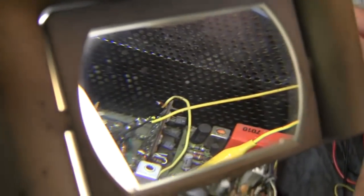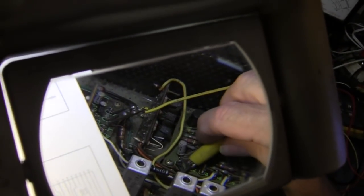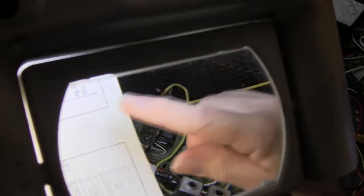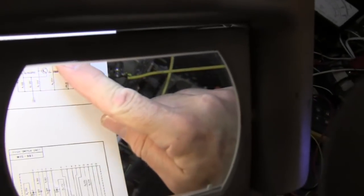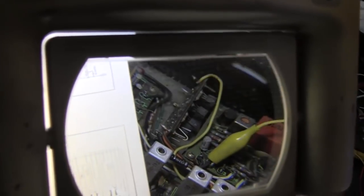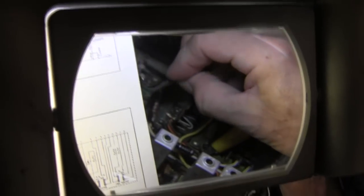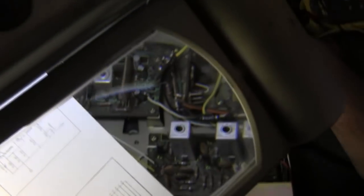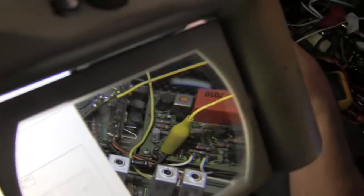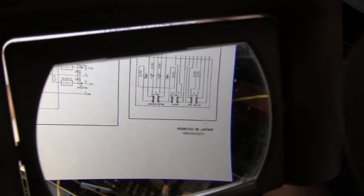There's a coupling cap between the two. Could it be that simple? Well, I think it's a coupling cap. Let me see, from pin 2. But it has three stages, so it could be a coupling cap pin anywhere. Pin 2, and there's a coupling cap on the board, but we jumper from, there's a coupling cap on the multiplex board. That's our output 3 goes to multiplex 2.